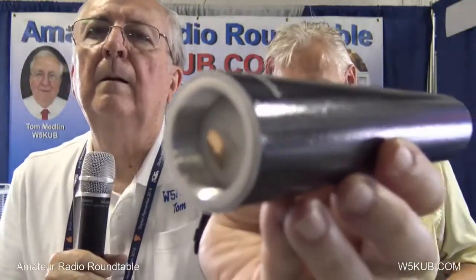The way it does that — most of your antennas out there, 99% of them are electric field antennas. Certainly the electromagnetic wave has magnetic components, but they don't utilize them very well at all. On the other hand, you have a few antennas like small loops that utilize the magnetic field — very low noise. Here you have an antenna that when you're losing the signal in the multi-path environment driving along and it flutters and you lose it, you capture it back with the magnetic field. So it utilizes both the electric and the magnetic field in a very unusual way.